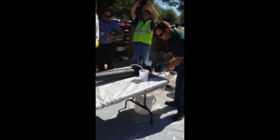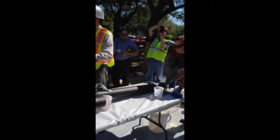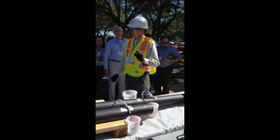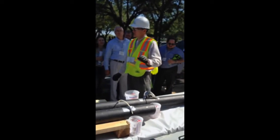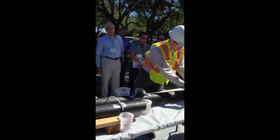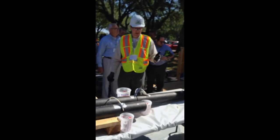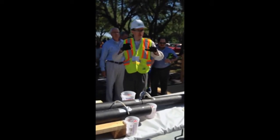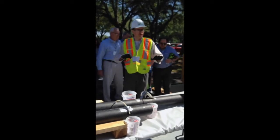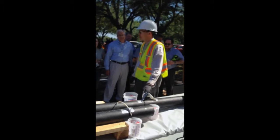These holes here are quarter-inch diameter holes that were just drilled at random through the duct into the grout inside, and they were drilled until we just touched the outside of the strand. Does this material harden over time? It will form a film on the surface of the steel as it basically hardens. It doesn't harden like an epoxy — it has more of a pliable nature to it. And you can see it's starting to come out of this last one here.